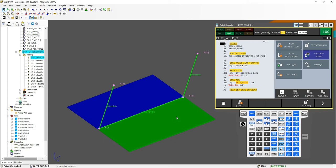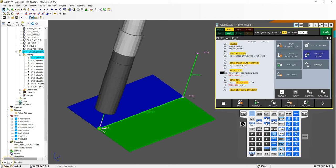I'm going to try two different things: we'll do the original weave, and then modify the weave so we can compare them. I'll bring the robot down to position one using step mode, and now we're in position one. I'm going to turn off step mode and shift — this is where we're going to weld start. I'll get rid of some of these lines because we're going to do a couple different portions here.